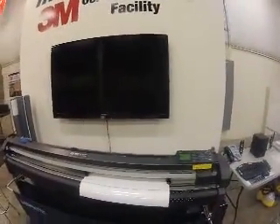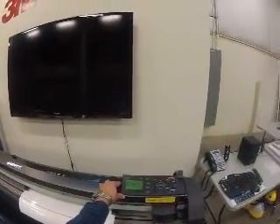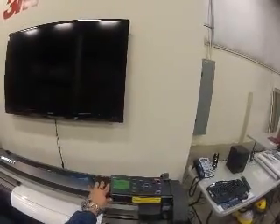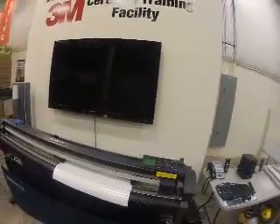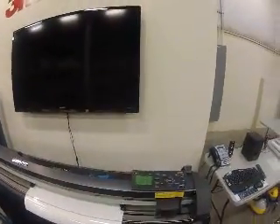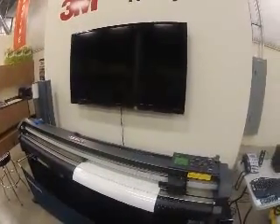When those are locked down, I know that I did everything possible to actually get that material as true and straight in the machine. When I locked my lever down, what I'm seeing on the control panel is roll one rear set, roll two rear set, and sheet. I'm going to use roll one rear set — you want to make sure it's set to rear set. If it says front set, it would actually scan your material and start unwinding it out of your plotter until it reached the end of the roll. After it scans, it's telling me my Y-axis is 23.2 inches.